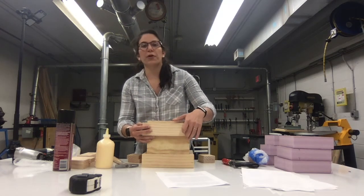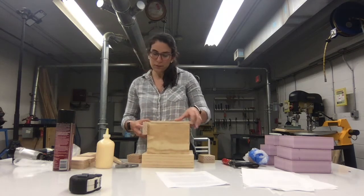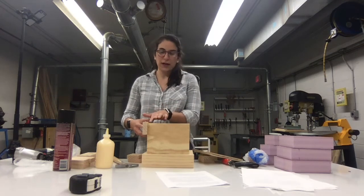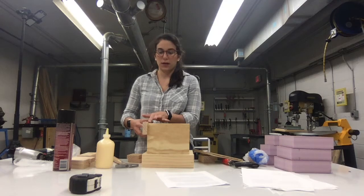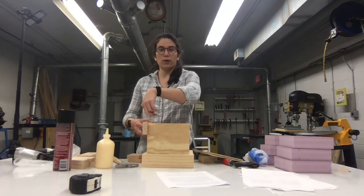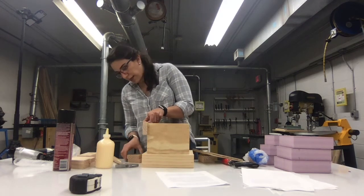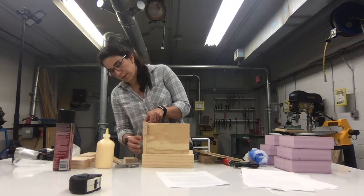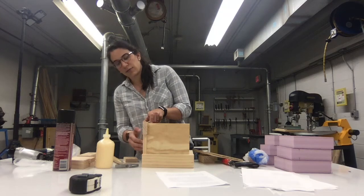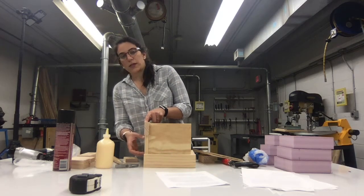coming a little bit over, okay? So when I remove my top, you're gonna have a little bit of over batten here, okay, to prevent the water from coming in here. So once I know that, that's when I took a measurement from the bottom of my batten to my top batten. And that is exactly how I figured out how big I needed to make this piece, okay?